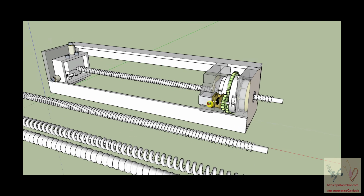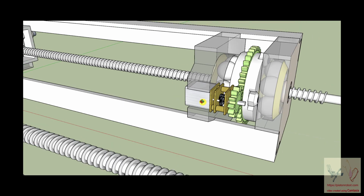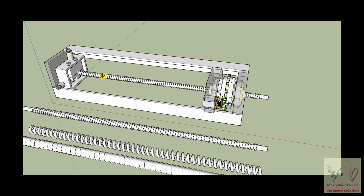And these little motors, gear motors like this, are available on the internet. If you go on the internet and look at them at the wholesale price, they're like $2 or $3. They don't cost much. I don't know if I'm going to do a lot of that math at this point. Just be aware that these motors are specified by their RPM and their torque. And if you specify the torque of this motor and you have the turns per inch, there are calculators on the internet where you just type all that in and it gives you the force. My memory is this has a pushing force of like 60 pounds, if I remember correctly.